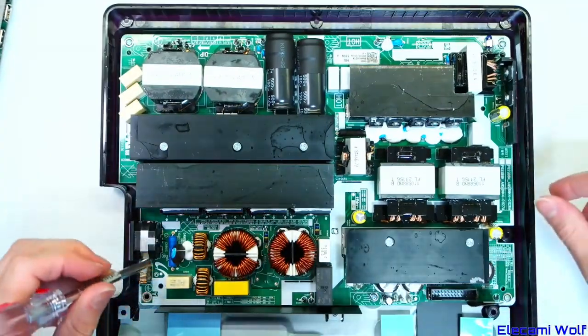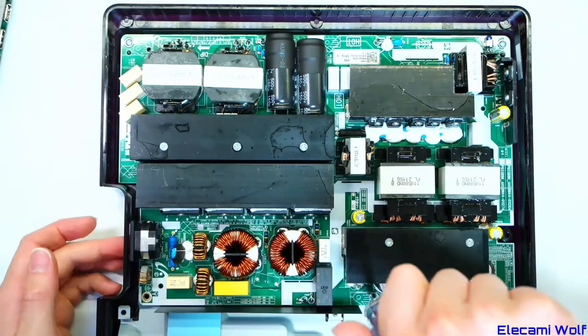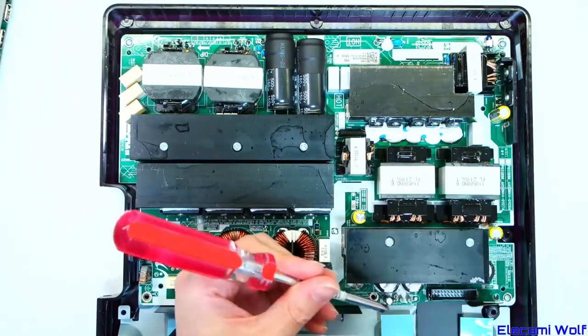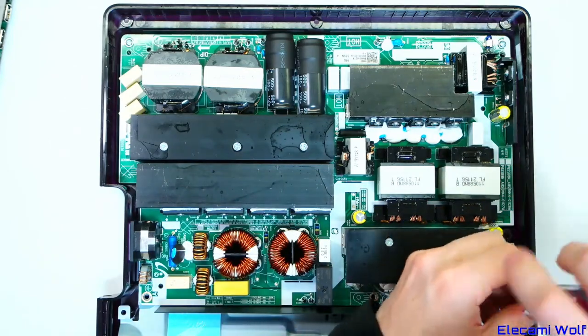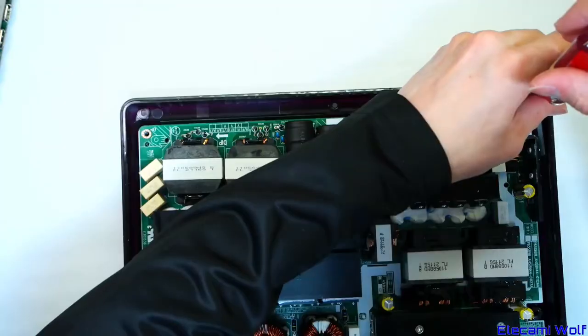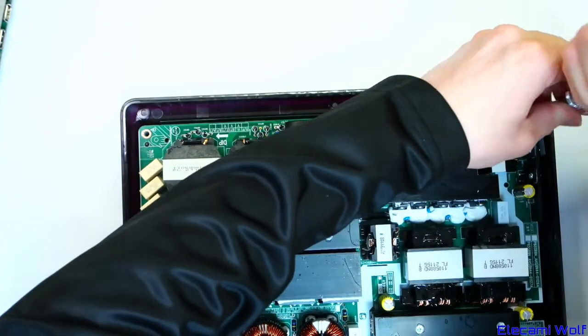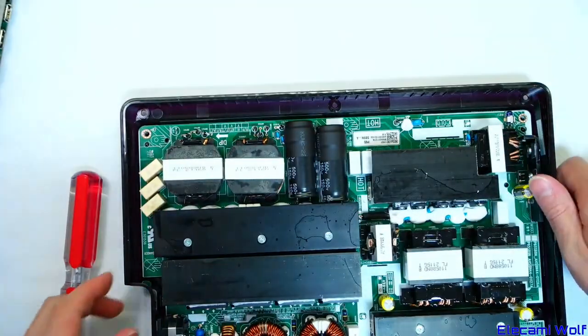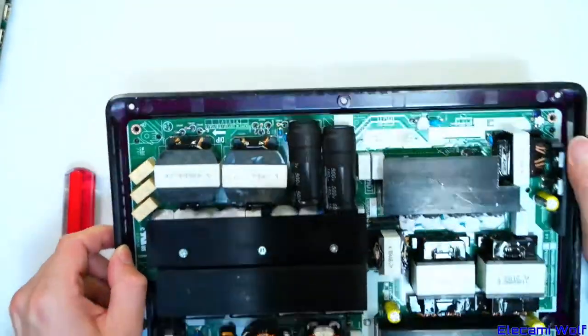Unlike the small One Connect box, this one has a grounded AC input. The other ones are all just two-wire with no ground. The TV is also a two-wire no-ground device — probably because it's a lower power device and hasn't crossed the threshold needing ground to decouple RFI.